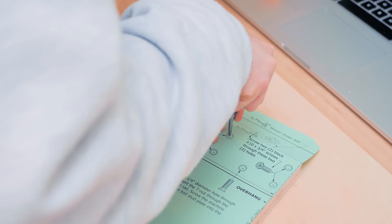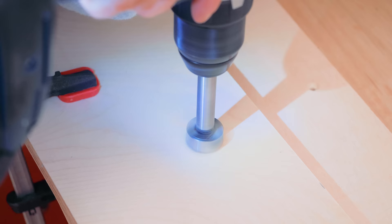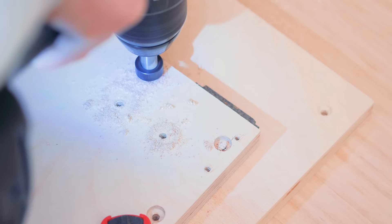After confirming the dimensions of the mattress box, I kept following the Murphy bed plans and drilling holes to attach the hardware components. This is a fairly simple system that consists of a pivot point and a piston lift mechanism.